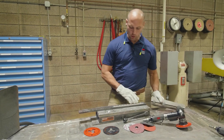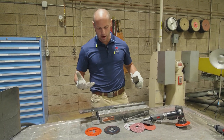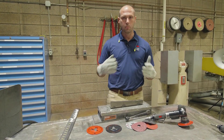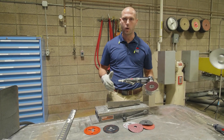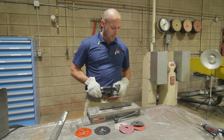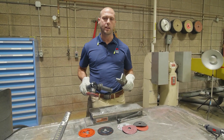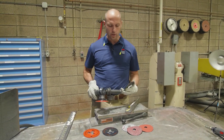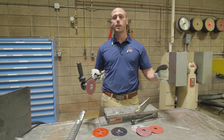If you don't have welds or a repeatable weld, you can grab a hunk of scrap metal and run a bevel test the same way — timing one disc against the other. You can also test end of life, though I must warn you: you'll be here a really long time because this stuff lasts forever. A great metric to use during the bevel test is to weigh the piece before and after. That gives you a solid comparison of how much material each disc removes, as well as the speed.